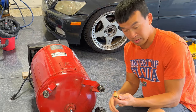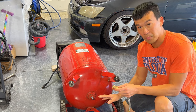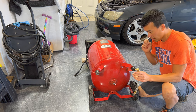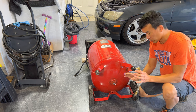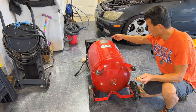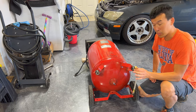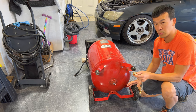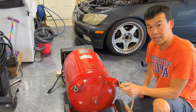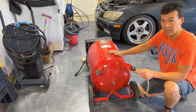If you want to see the one I got, I'll have a link in the description. They make three different types. This one is a simple relocation with a ball valve. They also make an automatic one that uses air pressure — every time the compressor kicks on and off it squirts out the water for a second, and that one's also about $15. The downside is you need to run a hard line from bottom to top; the included plastic line tends to fail, so copper or aluminum is better. The third option is an electronic one for about $30, set to drain every 30 minutes or an hour — good for a shop, but probably not ideal for an at-home 30 gallon compressor.